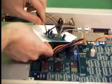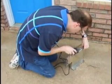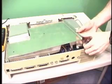For testing, I just placed the board on some cardboard to insulate it — I'll find a better place to mount it later. In order to replace the RF shield, it was necessary to cut a piece of it off with the Dremel. Afterwards, it fit right into place just fine.